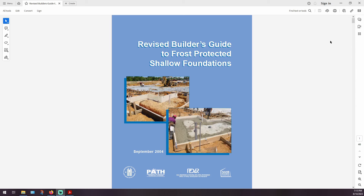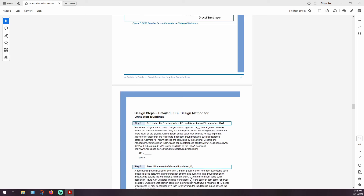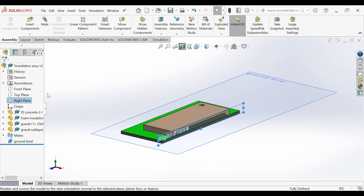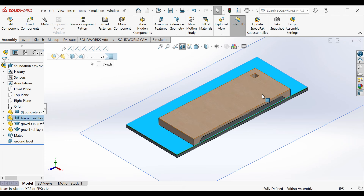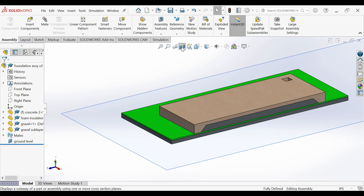If you want to create a foundation design of your own, simply find the type of foundation you want in this guide and fill out the numbers using reference material for climate and frost depth, and you'll get your basic design parameters. I went with the design for unheated spaces. From there, I plugged in all of the numbers and modeled the foundation in SolidWorks. The base layer is a 6-inch sheet of compacted gravel followed by a layer of R10 foam insulation that extends into an underground skirt surrounding the foundation. Next is another layer of compacted gravel, then the concrete is formed and poured on top. Note that I did not include rebar or mesh in this model and left their specifications up to the contractor.